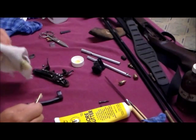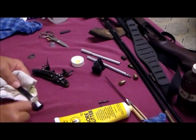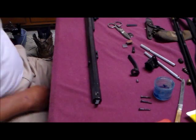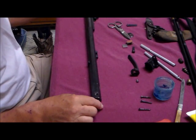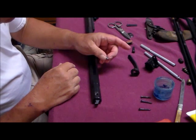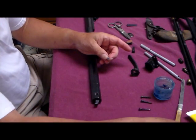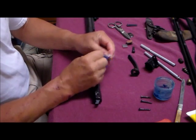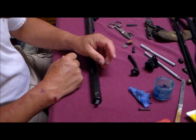What we're going to do at this stage is take some bore butter and apply it to the metal while it is still warm. You see how it melts very, very quickly and easily — this seeps into the pores of the metal and actually helps to protect it even much better than it would if you applied it after it was cold. A little goes a long way. Same with the tang here. We now have our sun-baked barrel, which is quite warm to the touch. This is the vent screw with a vent hole — in previous videos I mentioned enlarging it, and a 1/16th inch bit is what one would use, and that seems to work pretty well. Washed it, brushed it, and cleaned it on the outside and inside as well.